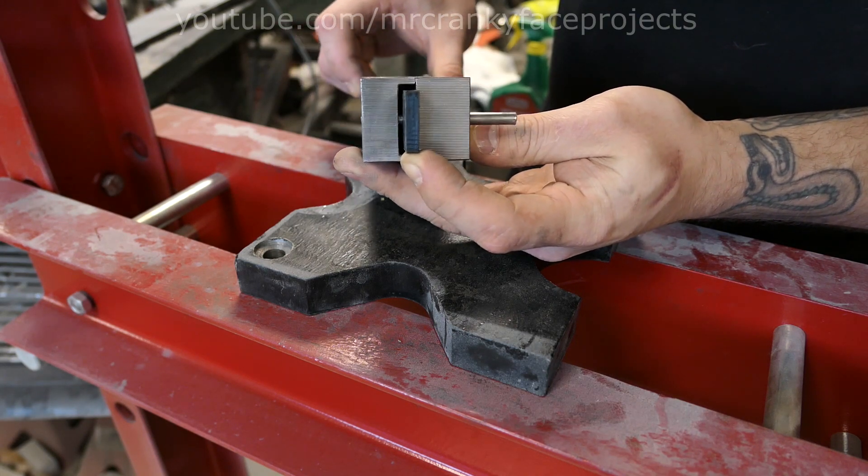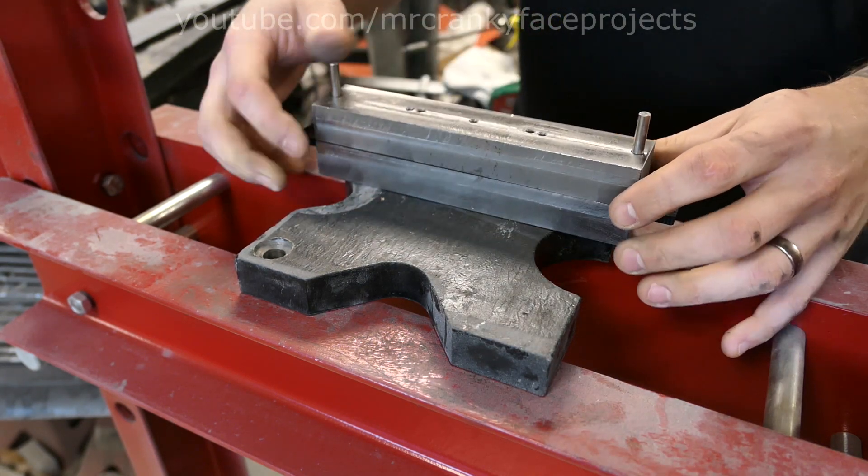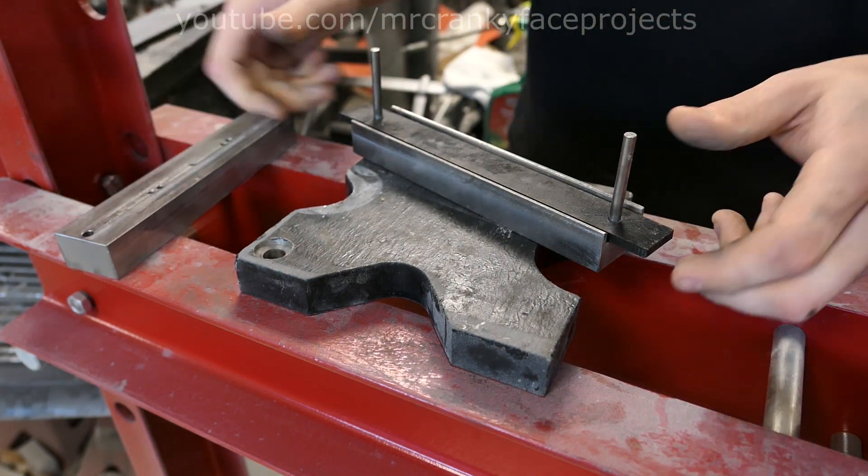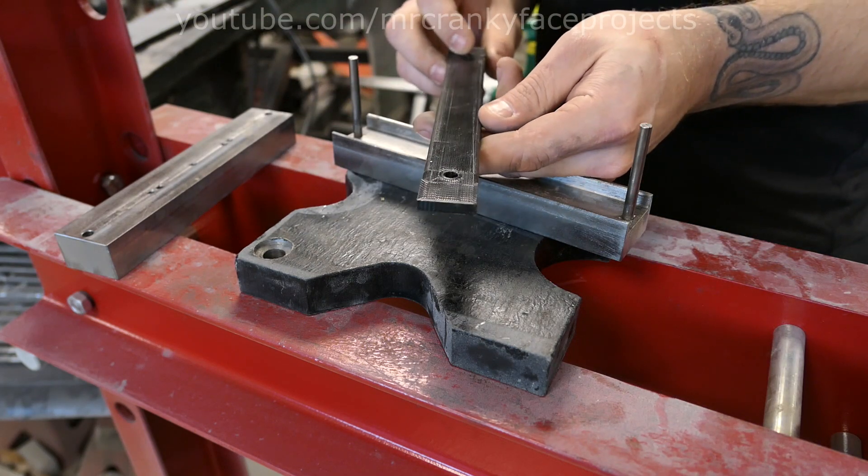The second chunk of steel is to spread the load from the hydraulic ram and support the much weaker plastic shaping die. And that's a finished press tool, ready to use with 1.2mm sheet metal — in this configuration for a very specific shape, so maybe not universally useful, but the general idea can be used for a lot of shapes.